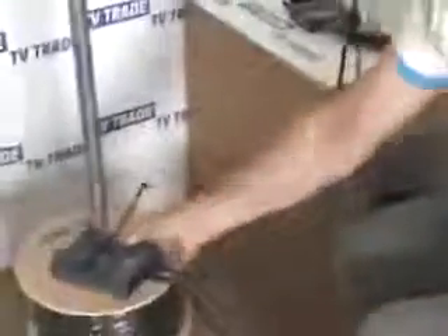The other alternative, as I mentioned, is you can just put it in the attic. We'll run this cable inside into the house and connect it to the cable that's running down the wall into the room where you wish to locate the satellite box. So we have a single cable running through. We'll take this as being the far end of the cable coming from the satellite dish and feed it into the Destacker.